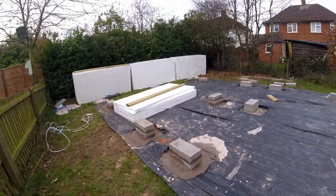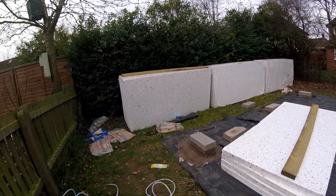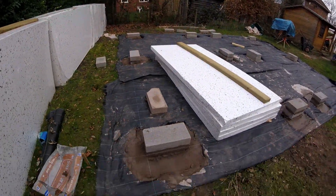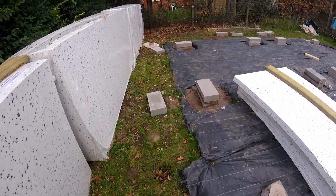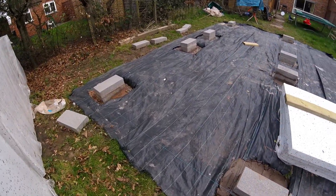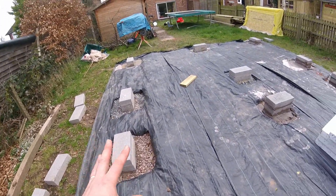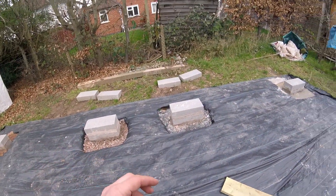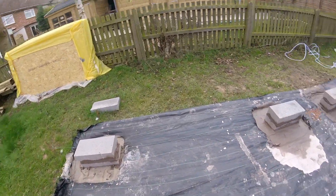The foundation piers are all finished and cemented. I disposed of the leftover cement and sand by just filling the bottom of some of the remaining holes — I don't really need it there but it's a good way of using it up. I've also got some rubber strips of different thicknesses that I'm going to use underneath the base to make sure I can fine-tune everything level.